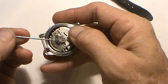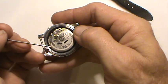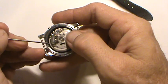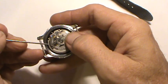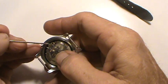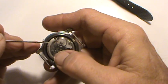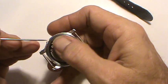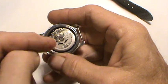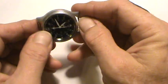And when I first put it back on, I had a stuck spot. It would go part way and then just stop. I had to pull it back apart, and then on the bottom side of it, a little bit of that super glue had weeped out between this plate and the edge of this, and so riding along this little groove all the way around here, it was just getting caught. I'm guessing one of these bosses that are sticking out here, something like that. It was just coming up, and that tiny little bit of glue was just hitting it. So I got that little bit off, and it's golden. It's working. So we'll put it back to work, and we'll revisit this if and when it fails again. So we'll see how long that super glue fix on this self-winding Seiko 5 watch lasts.